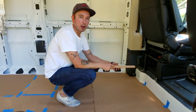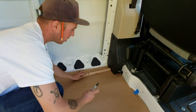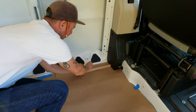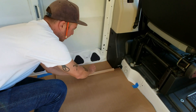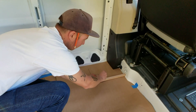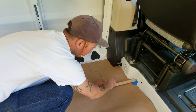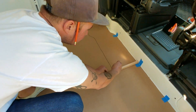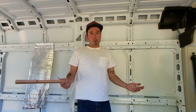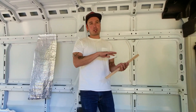The scribe butts up against the metal and creates an exact profile of the van wall. You take the piece of wood, butt it up against whatever you're trying to trace — in this case, the van profile — and follow the van very carefully. You get all these weird curves, and what you're left with is a line to cut out. Next, we take our pieces of plywood — three-quarter inch with a weather and water resistant treatment on top — and lock the tongue-and-groove pieces together, then place the template over the top and trace it out.